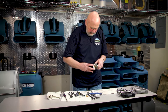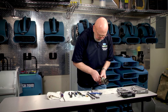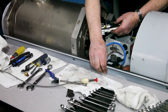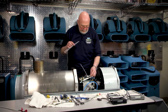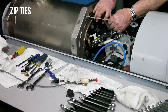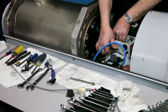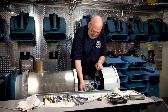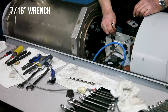Slide it back on, make sure that it's good and clean, cinch it up, and then insert it back in the barrel. Put the ignition hookup back on the fuel tube and zip tie it in two places, getting it back close to where it was when you took it loose. Put the cinch nut back on and snug it good and tight. Check that it's not moving around in the barrel, then hook your fuel line back up — good and snug, but don't over-tighten it or you'll crack the copper. Then put the igniter back on.